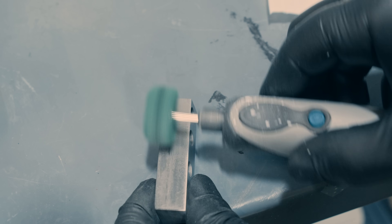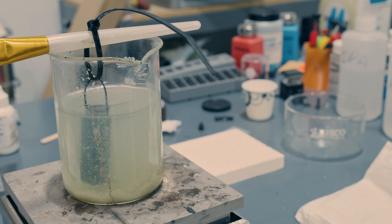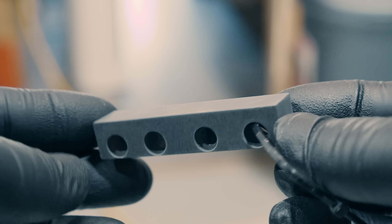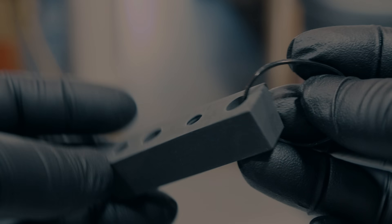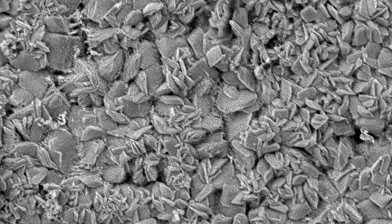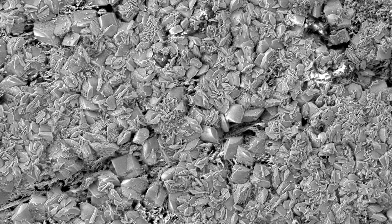This time around, I hit it thoroughly on all sides with a 120 grit sanding wheel to ensure a consistently matte, rough finish. I also increased the temperature of the phosphating bath — I think it was a bit too cold last time. And the results look much better. Still a little splotchy in places, but nice and dark and relatively consistent. Under the electron microscope, the coating looks a lot different from the first attempt. It seems very even across the whole surface. The crystal growth itself is much smaller and more consistently sized. We don't see any big cracks and the surface looks nicely porous. This is probably what you want in a coating — a nice, consistent, even surface with same size crystals everywhere.